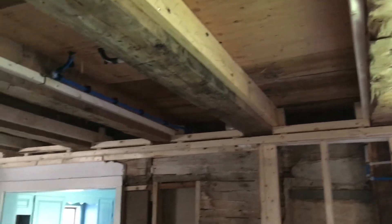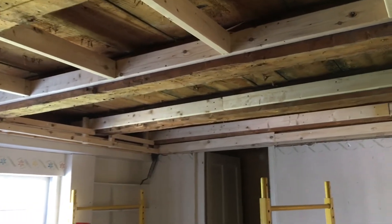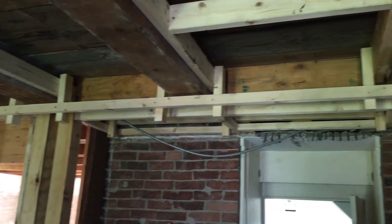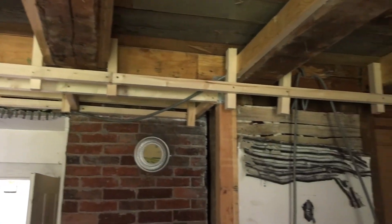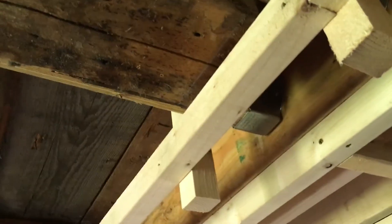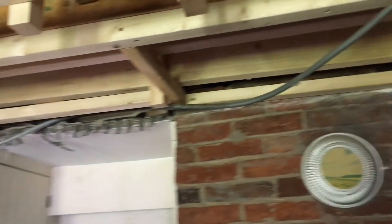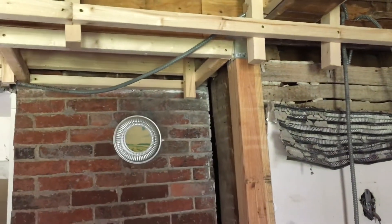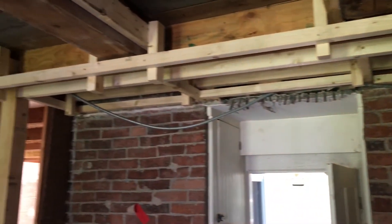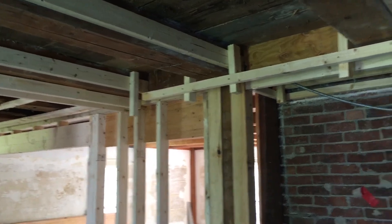The exposure is not going to be full depth like it is in the living room — it's only going to be about an inch or so at the bottom of the beams that will be visible. Here's the area where the LVL was installed to repair the fire damage, and you can see that there's also a similar soffit being built on this side to box that in, because the end of this beam is essentially right here. So that's got to all be covered up — we don't want any of that to be visible. This is all going to be boxed in and ultimately sheetrocked, so that will not be visible, but the beams will be exposed across the front. And that soffit will provide nice space for running electrical or any other mechanicals that need to be run through this space.